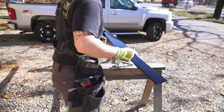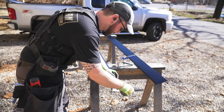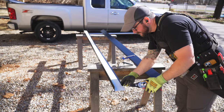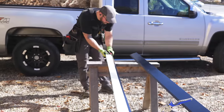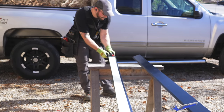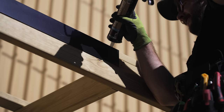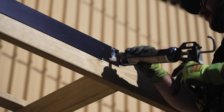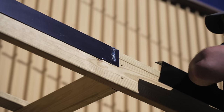With the first piece installed, I could just repeat the process down the rest of the roof. The next pieces in line only needed a section of hem removed at one end. I also spread the hem a little bit at the other end where it would lap onto the previous piece of drip edge, and this just made things easier. I could get the second piece installed once that was done.